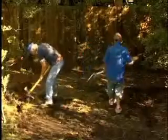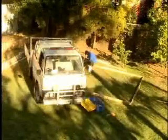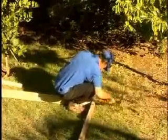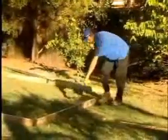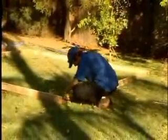Visually establish high points and low points and use soil to level the area as best as possible. Measure and construct the box away from where you plan to put the slab. This gives you room to manoeuvre and work. 30 by 100mm treated pine is ideal for the box frame. In this case, the box dimensions are 3.1 by 3.1, which allows for a 50mm rebate.